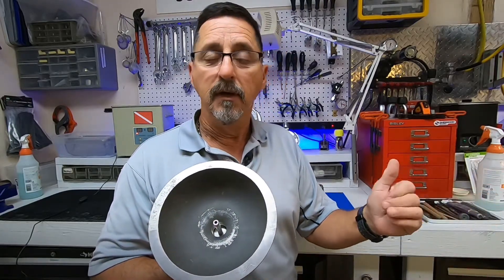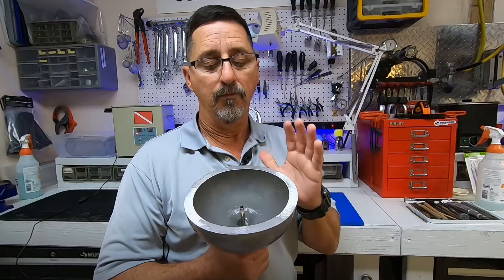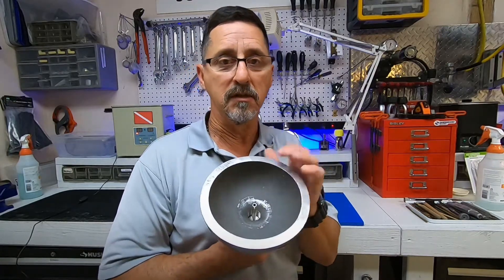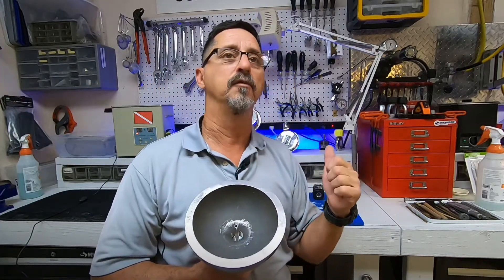This is not the first time I've seen this happen — it's actually the second time. The main cause is the corrosion inside the actual dive tank. To reach that level of corrosion inside a dive tank, it had to go a long time between inspections. Annual inspections are required for consumer dive tanks. For rental tanks from a dive operator, at least every six months you should be inspecting the rental fleet, because corrosion can accelerate rather quickly.